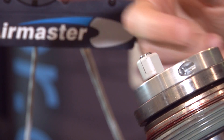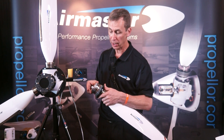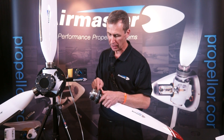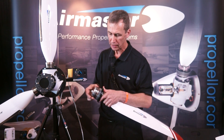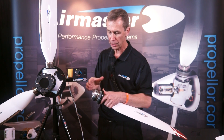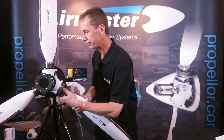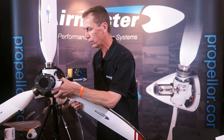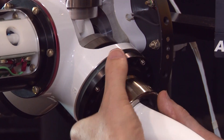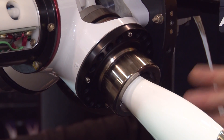This is the pitch change cam. It fits into the pitch change block and aligns accurately into the hub to allow the blade to be set at the right pitch. There is a retention bearing set here and here — one does the alignment of the pitch change, the other takes the main thrust loads of the propeller. These two work together to provide precise alignment so that when we put it back into the hub, we're able to torque this nut up and preload one bearing set against the other. That's a unique way of making sure there's no backlash in the system, much easier than the split hub type where you have to use shims for the same purpose.